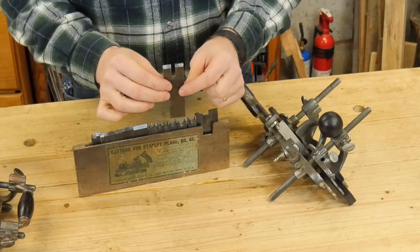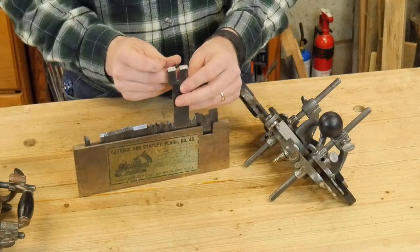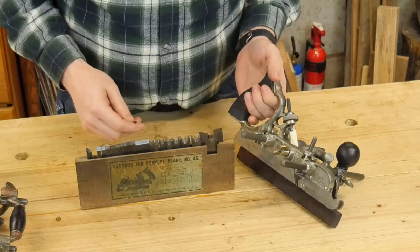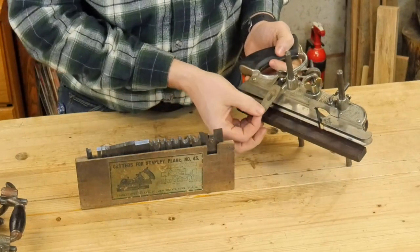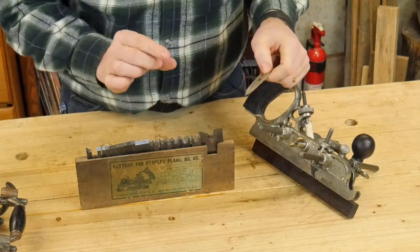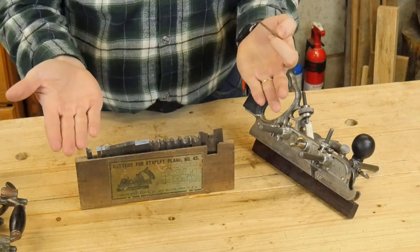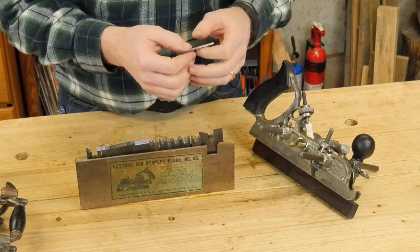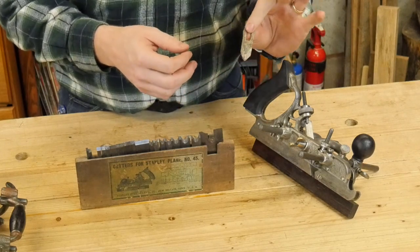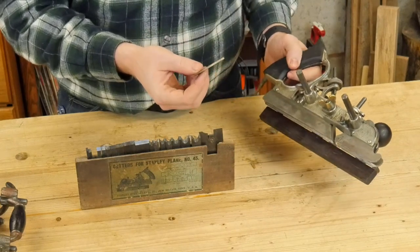You can also cut tongue and groove with a tonguing iron — one iron cuts the groove and the other cuts the tongue. Another use for the Stanley 45 is the slitting cutter, which turns it into a slitting plane. What that does is cut thin stock material without leaving a kerf, so you can theoretically put those pieces back together. Or if you need to make a cut without a kerf, this is sometimes useful — I've seen it used in a few box items. I've honestly never used that cutter for the 45, but if you need it, it's there.